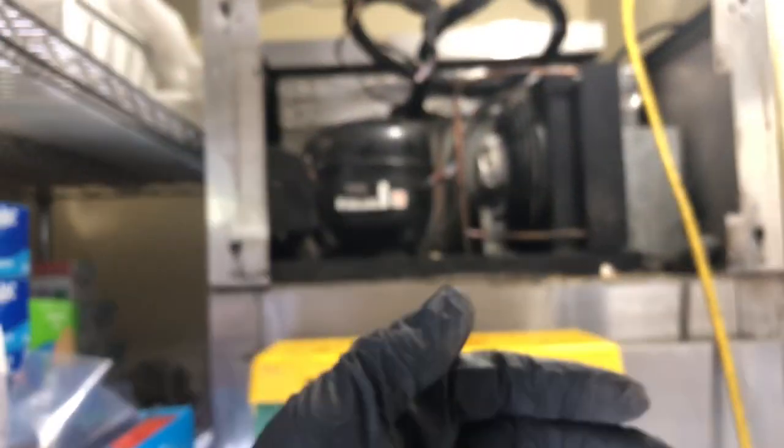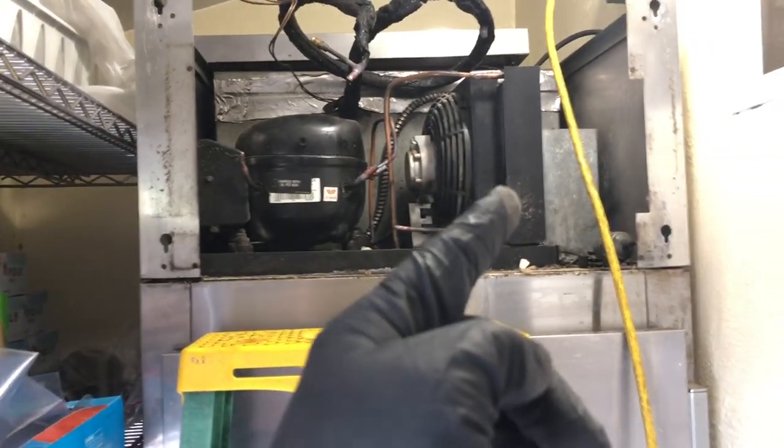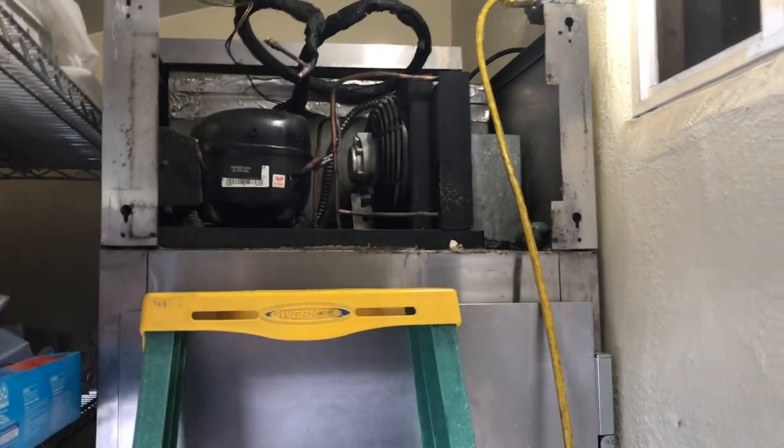Suction lines out, I got the mounting bolts out. This — which is the drain pan in the deal — will take this whole unit off of the freezer. They can do a deep clean on the condenser and change out that condenser fan motor; that thing's old. This is going down.